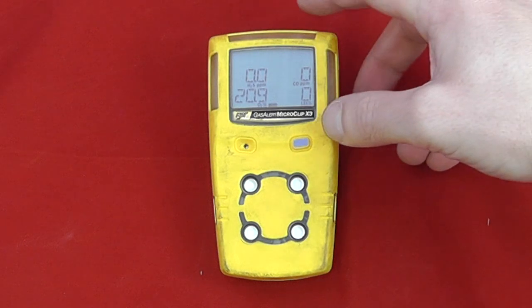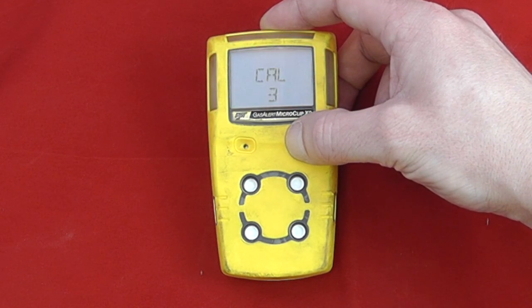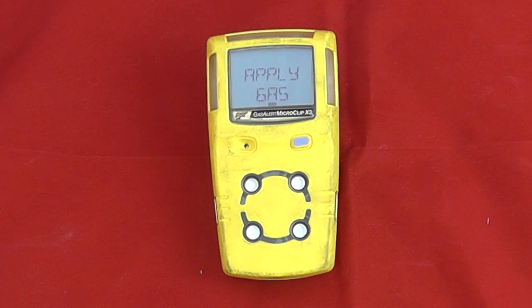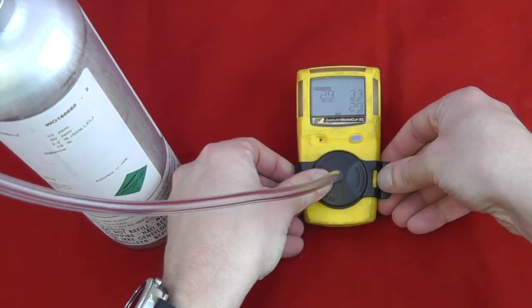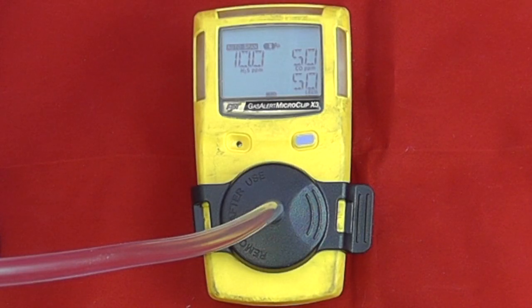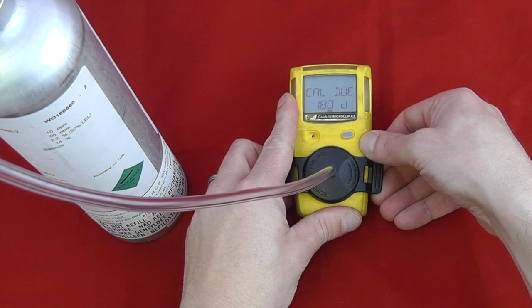If you are required to do an on-site calibration of the device, press and hold past the off button, keep holding, and it gives us the option to do a calibration. The first point is to perform point one of our two-point calibration, which is to apply a zero, and then it requests that we apply gas. I'm going to open up my standard full gas mix and apply the calibration adapter to the front of the device. It will then provide an auto-span based on the full gas mix. We can see the span calibration has been successful and the cal warnings have been reset to 180 days from now, so the cal is now due in 180 days. We can now remove the gas from the unit.